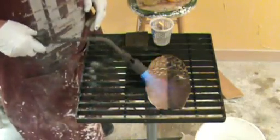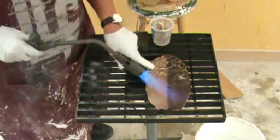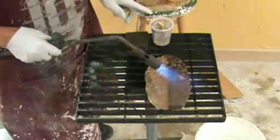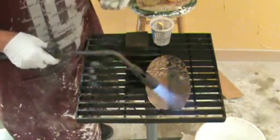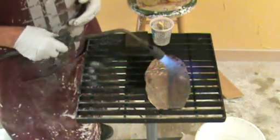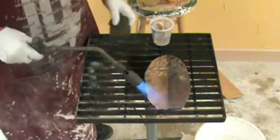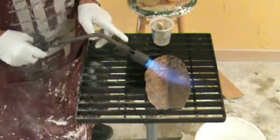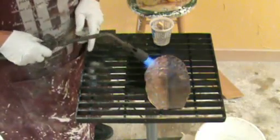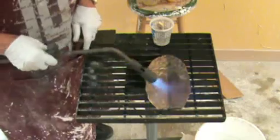One of the three most important parts of a hot patina is the metal itself — how well it's been cleaned and how shiny the surface is, depending on the kind of patina you want. The second thing is the strength of the chemicals: the more chemical, the faster the reaction, so if you're beginning, start with a very diluted solution. The third thing is how hot the metal is when you put the patina on — very crucial. Use propane or gas-air rather than oxyacetylene, which has way too much heat. You're looking for about 220 degrees on the surface, with the torch head at around 1800 degrees.